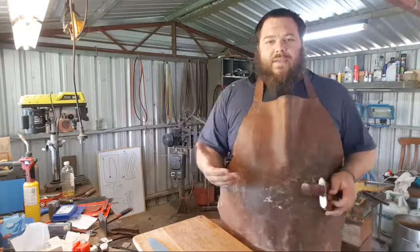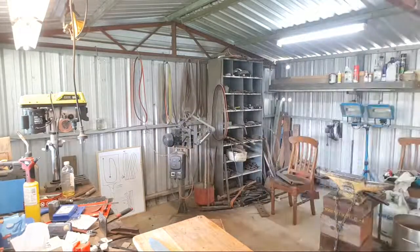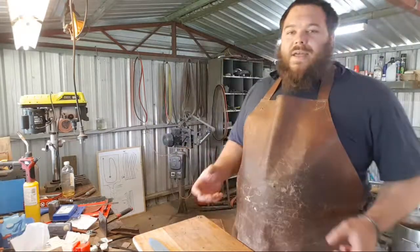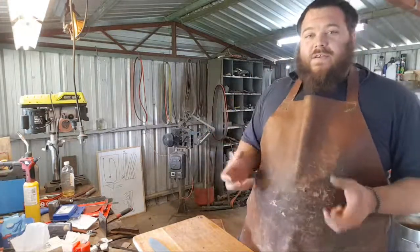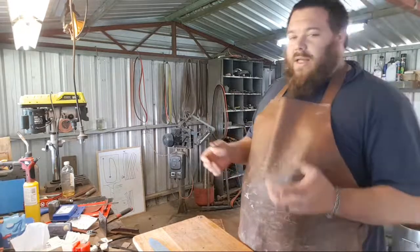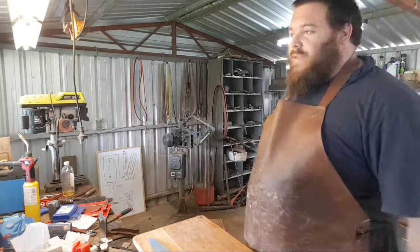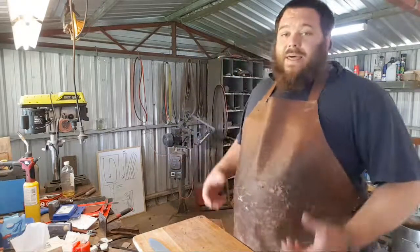The thing is, at the end of the day, even gun oil doesn't protect steel from fingerprints. If someone picks your knife up and puts their fingers on it, the oils in their fingers will creep under that gun oil, and it'll start rusting the blade. It'll start pitting it, because there are acids in human skin, which is why you're not supposed to pick up frogs without wetting your hands first. Because there are acids in your skin that will literally start eating at the blade.